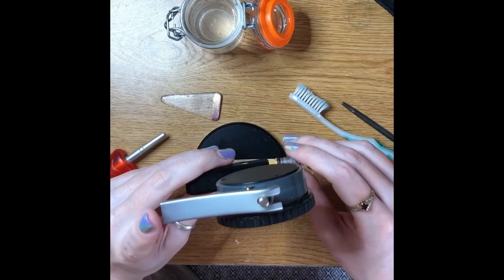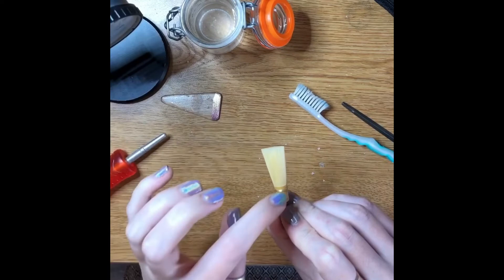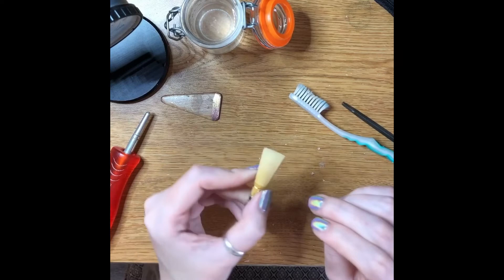I think that's pretty good — it's down to 0.76 all around this back collar area. Whatever you do to one side you want to do to the other, because you don't want one side to be uneven with the other. These are going to be vibrating against each other so you want them to be parallel.